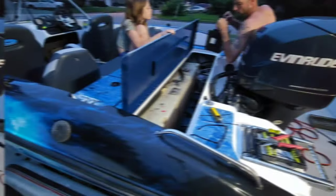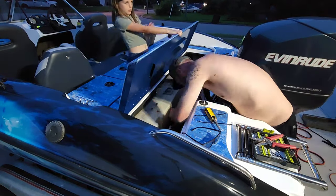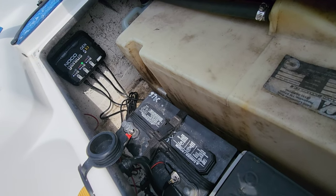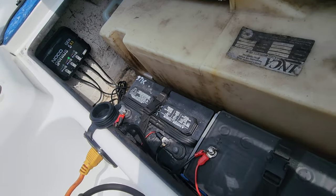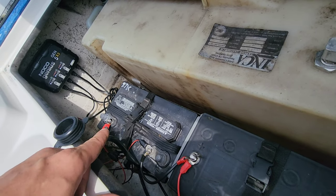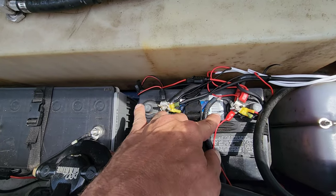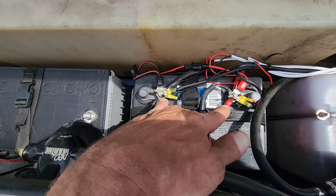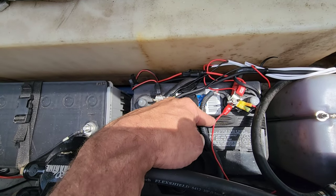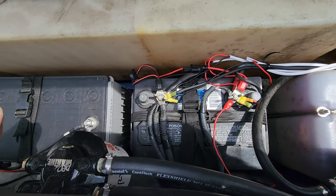I'm going to put all these batteries back in here and clean all this up. All right, so you can see what we got here — I have my tender over there in the corner, I just plugged that in. Two of my batteries are full and one of them is charging. The two that are full are these two right here — those only have the cables on them for the trolling motors, 24-volt trolling motor, and it has the battery tender cables on each one of those. This is my main starting and cranking battery right here. I've got a lot of electronics running into this boat but everything works out perfectly. I'm going to come back and clean this wire up with some loom in here. I just double-checked everything and it works perfectly — this is the one cable right here coming from the float switch, and what that does is when that float comes up it bypasses the switch and tells that pump to kick on.